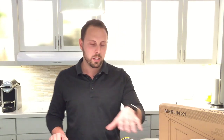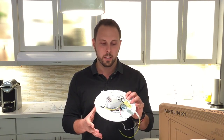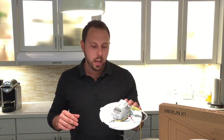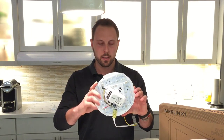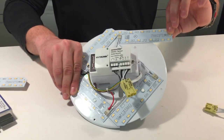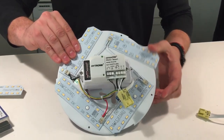I'm going to start with our LEDCR module shown right here. This is a circular retrofit designed to retrofit existing surface mount drum fixtures, and it's sometimes used in pendant fixtures. It's a nine inch diameter disc with four LED boards that are designed to swing out, so this one unit can fit a number of different sized fixtures — anywhere from ten inches in diameter all the way up to maybe two feet in diameter — and illuminate those fixtures uniformly. It's very flexible.